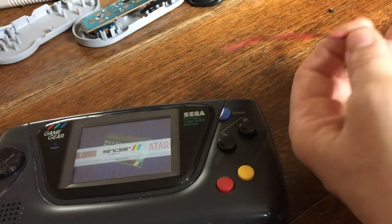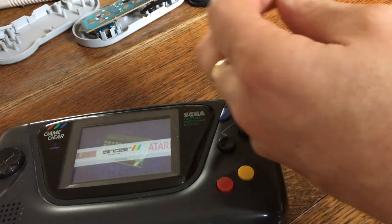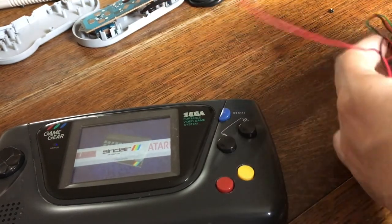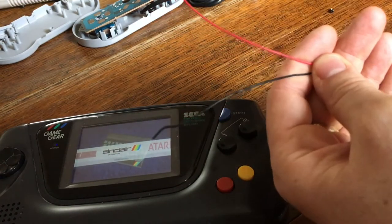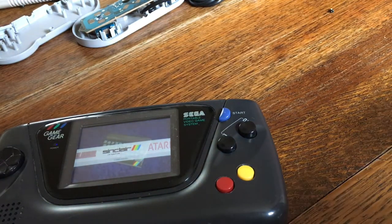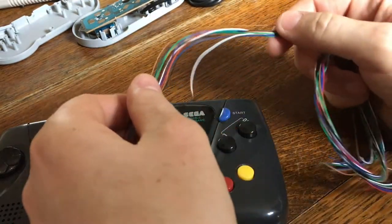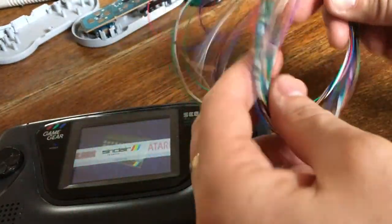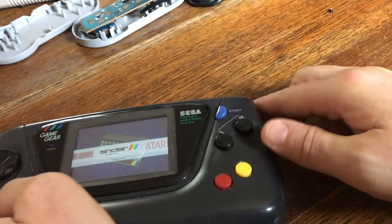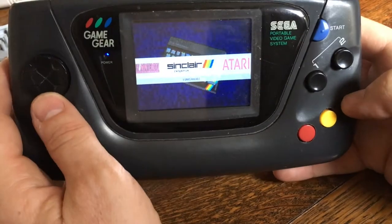Well, for power wires, I tend to use, I'm a broadcast engineer, what we call in broadcasting this kind of Krone hookup wire, or jumper wire, it's often called. This is a solid core wire, and it comes in numerous colours. I've got a bag of different colours here, and it's useful for doing the power hookups because you want to know that you can reliably take that 5 volts and probably an amp of current when the machine's booting up. But for all the hookups for the controller and the audio board and such, this Kynar wire, which you can buy in 5 meter, 20 different color rolls on eBay for a few pounds, is ideal because it's very flexible and very easy to dress around the innards of the machine and produce quite a nice result.